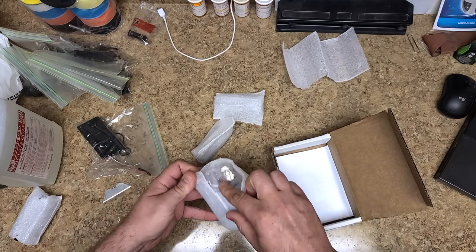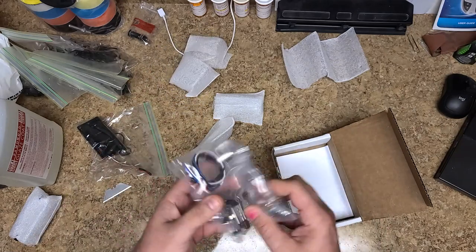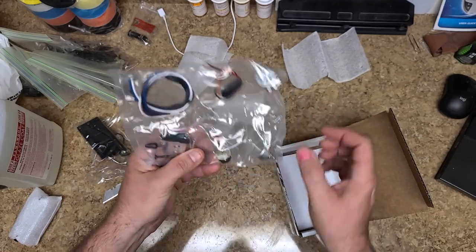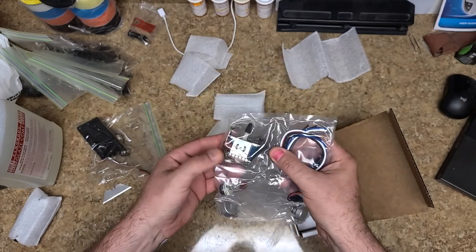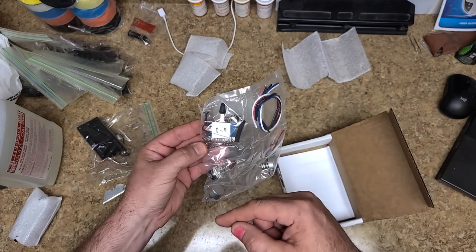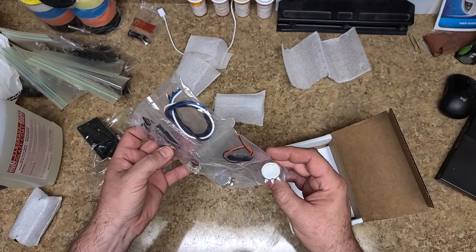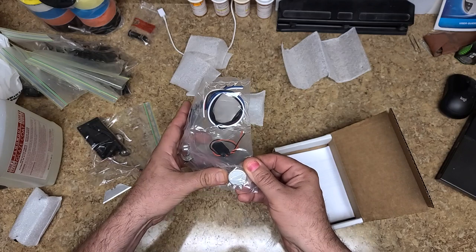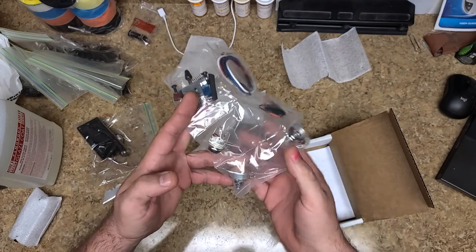This is the goodie package it comes with. I've got the pots, the battery control, some wiring, and an output jack — though I'm not going to be using the output jack. The five-way switch I really don't care for; this is kind of the box five-way switch that was on this guitar to begin with, so I'll probably use one of my own. These pots are made in Korea, so I won't be using them either — I'll be using CTS pots.